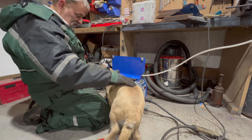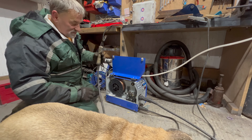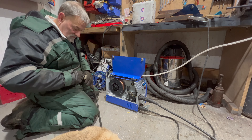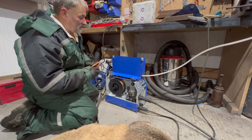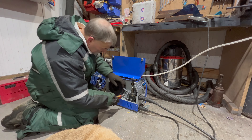So I'll give you a quick idea of how we're inside a MIG welder. On a MIG welder, how it works is you have the coil — a reel of wire fed down the gun. When you pull the trigger, it operates the solenoid, drive wheels feed, and it feeds the wire through. So all I'm going to do today is actually change that wire. First of all, I'm going to take the tip off, which is a 0.6 tip — that means it's got a 0.6 of a mil hole in it. And we'll put that away. Then the next thing I'm going to do is take the spring tension off. You can see the wire sat in its groove. Now with my pliers I'm just going to cut the wire. But be careful when you cut the wire — I can pull it back. So I'm pulling the wire out. That's the wire pulled out.